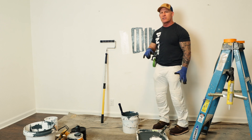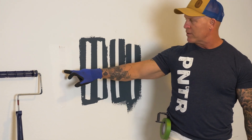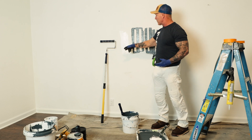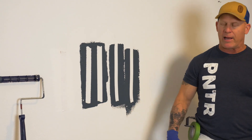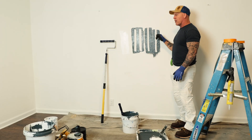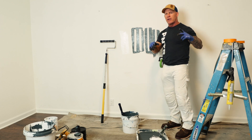Before the caulking and the paint dry, you pull your tape and you'll have this laser-straight line. With the paint method, you're having paint that's bridging over the top of your tape to your wall. That dries, and when you pull your tape you could get what we call bridging or shark's teeth — it'll peel from your tape to the wall and peel it right off. That's why we always pull our tape before the caulking dries and before the paint dries, so you don't get any of that bridging.